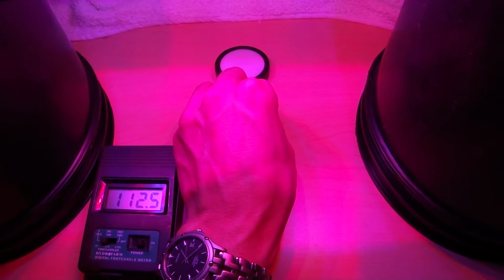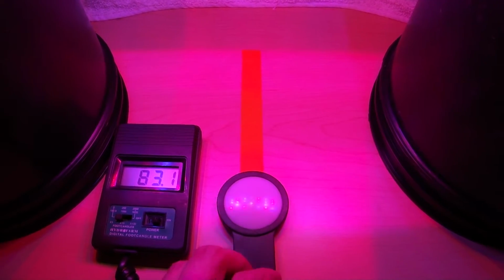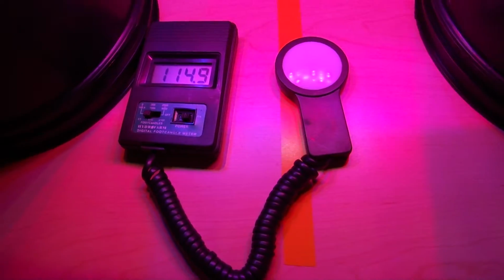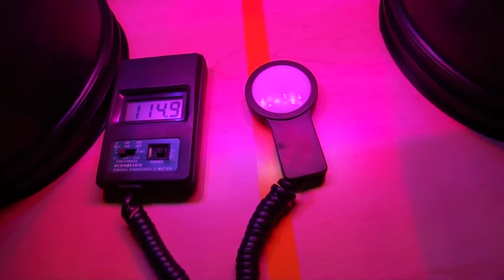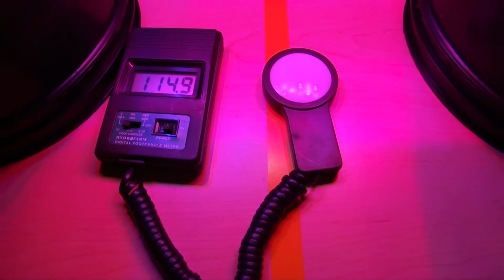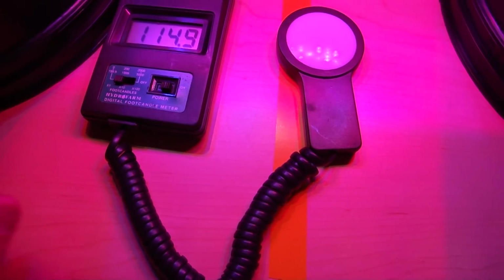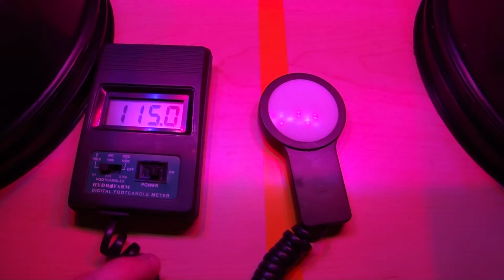And the reason why we have the high point is we're actually getting reflection. The reflectors are actually giving us light that would have been lost back down. And the reason why I'm showing this is that when you go and you look at a lot of these LED fixtures out there, they're just a PC board panel with LEDs on them, and they're all flat, and there's no real optics going on. So you have quite a bit of light lost. Within that, you don't really want to be looking at LEDs. They're actually bad for your eyes, worse than anything else, minus something that has UV or anything. Excuse me, because you have a really bright blue and a really bright red peeking at you.